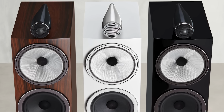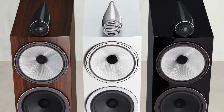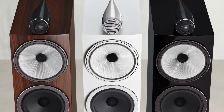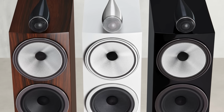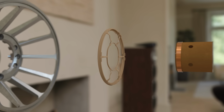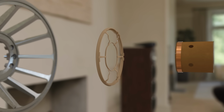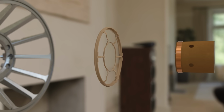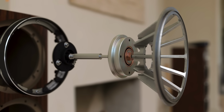They call the bass cones Aerofoil profile since they are thicker where they are driven near the voice coil former in the center. Those are 6.5-inch each. They're a composite structure of two paper cones with a lightweight foam in between. These offer lightweight, stiff, and non-resonant performance optimized for frequencies from the upper bass down. So each of the three driver types is optimized in multiple ways with technology and design specific only to the particular frequency range it needs to reproduce.